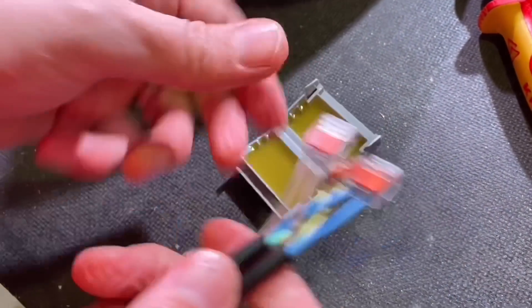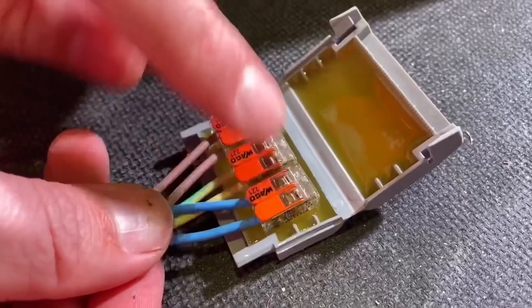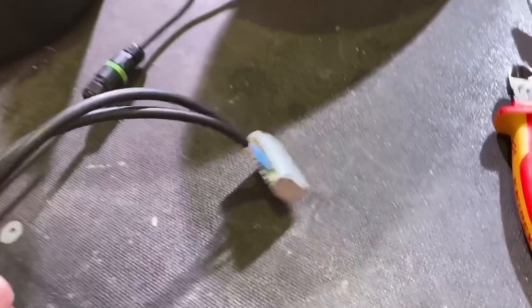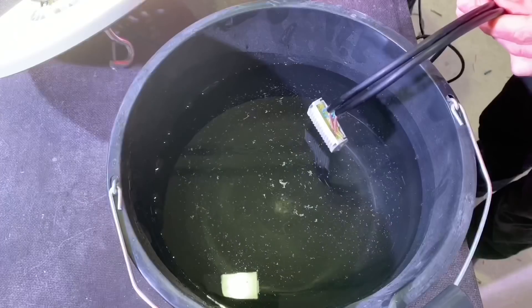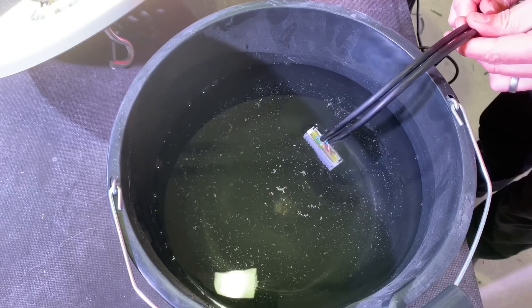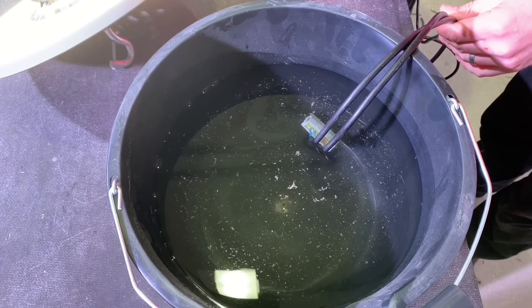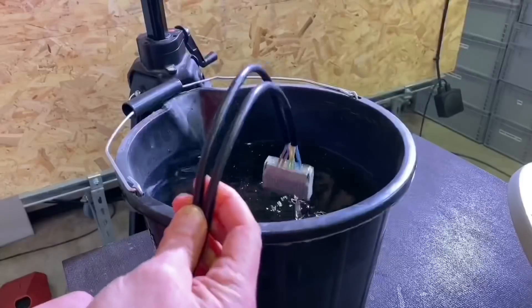Do not try this at home. I've prepared some ends with flexible cables using the 221 series connector — exactly the same principle. Press them into place. We're going to liven this up: we'll attach a LED high bay to it and drop it straight into water. The gel is ready. The light's lit — we're live now. And we're in. We'll slosh it about. This is rated IPX8, though our bucket doesn't mimic that depth or pressure — I'd suggest this is more of an IP67 test. The high bay light is still lit and we haven't tripped any breakers.